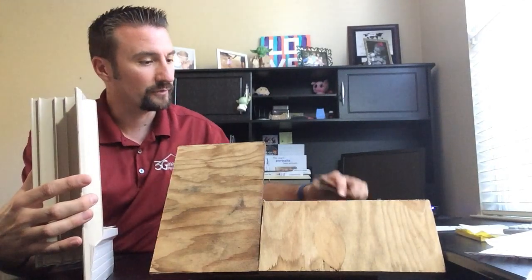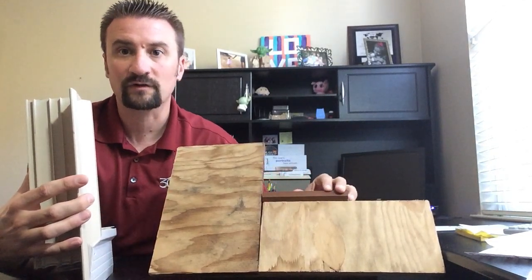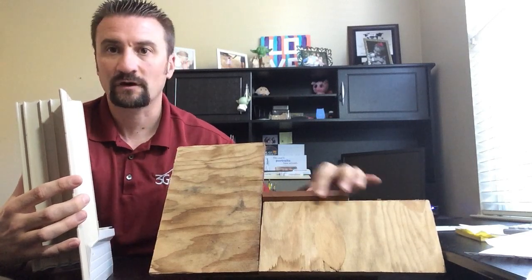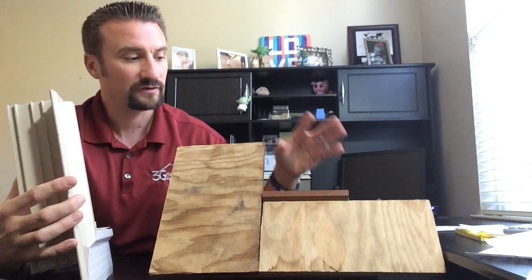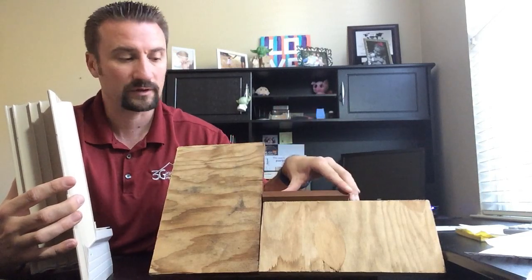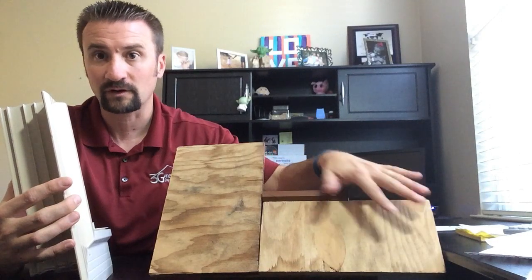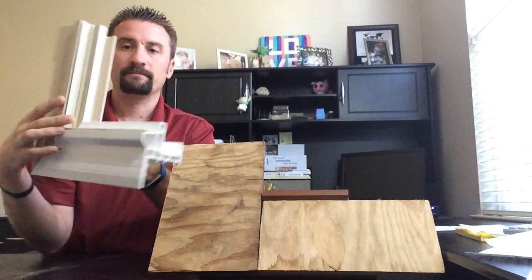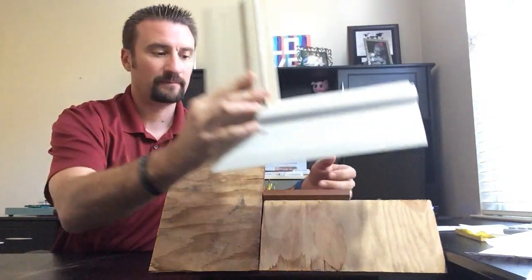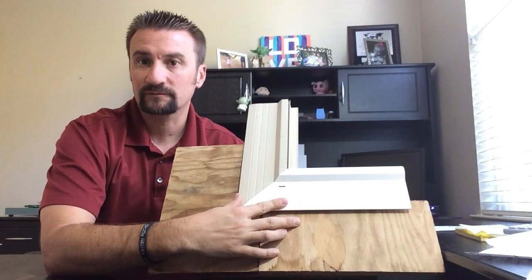We're going to pretend like this is the framing on your house now. Usually it's a window frame, usually aluminum or steel. What they do is they take the glass out of this opening. They leave the frame in place with whatever flashing exists there. They don't know the flashing that exists there. And then they take that replacement window from the outside over the top of your existing frames.